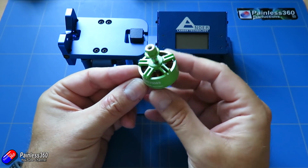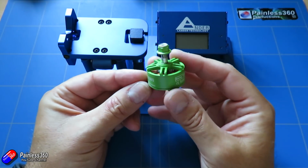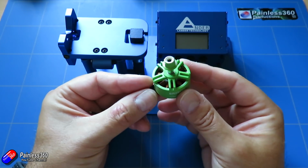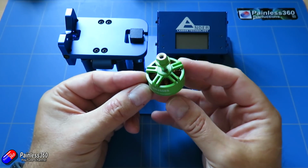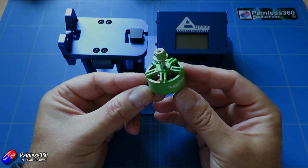So anyway, join me in the next couple of videos as I investigate this and work all this out, and hopefully we'll end up with a quadcopter that we can test to see whether or not we can actually get some decent flight times with these new low kV motors designed for 6S batteries, but you're running them on 3 or 4S with a nice 2-bladed prop.